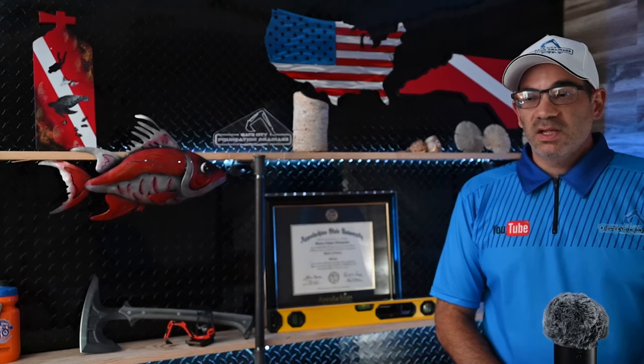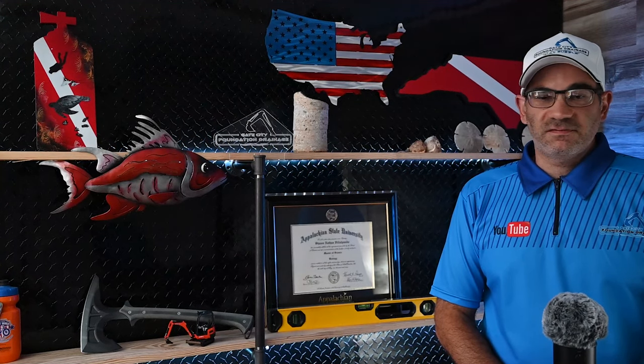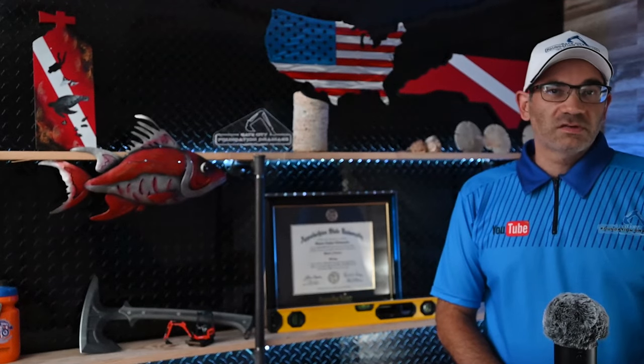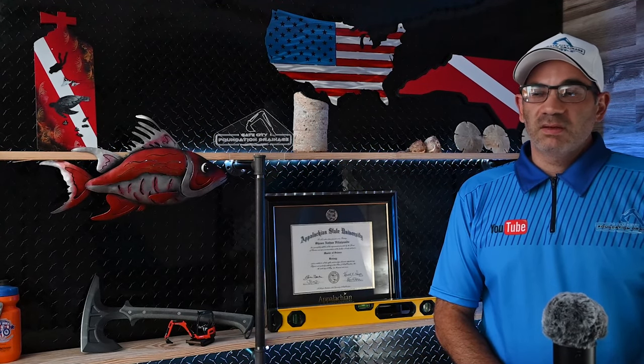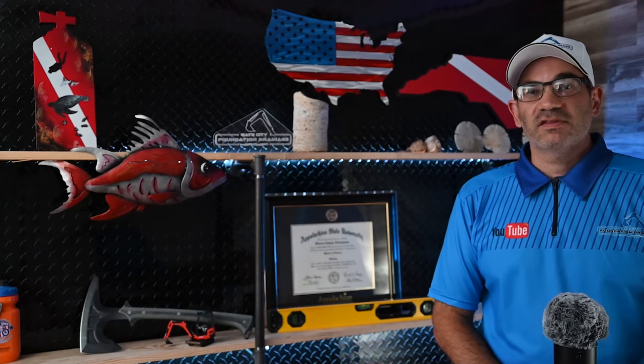And so taking the driveway up, cutting the grade down, putting the driveway back where it was lower than the foundation, lower than the slab, and shedding away from the house. What that means is the heavier the rain, the more rain, the faster and harder it's going to flow away from the house instead of the opposite if we had left it. And so this was really the only solution that was going to be 100%, because even if you get 99.9% results, the house still floods. And so you haven't really achieved anything.